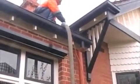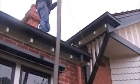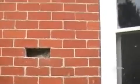Hayden's lifted the tiles off, which gives him access to the top of the cavity wall and the Rockwool can go straight in. As you can see, when it's full, it fluffs right out. You can see it blows around and around, gradually filling up the space until it's full in its entirety. That's obviously important to ensure you've got no gaps and thus no heat loss through your walls. I'll just get my friendly bricklayer back, put the bricks in, and they'll look as good as new.